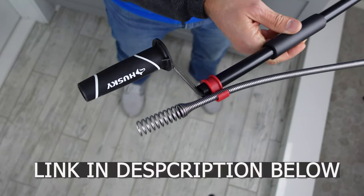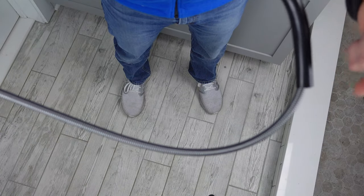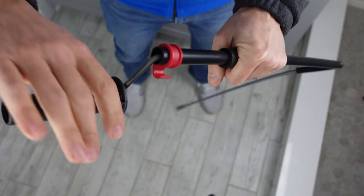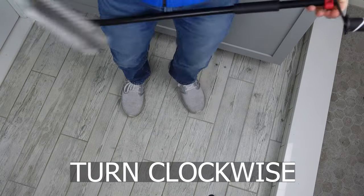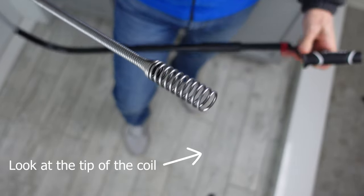Now there are a few key parts of the toilet auger. You'll see at the end an expanded coil, and then you have a handle with a long plastic shaft that covers the remainder of that coil — it runs end to end. The tip is wider than the remainder of the shaft, but it's all interconnected as one piece. When you go to insert the toilet auger into the toilet, grab the actual shaft — there's a padded handle — grab that firmly with your hand, grab the handle, and turn it clockwise. When you turn it, the coil actually turns, screwing into the material in the toilet.